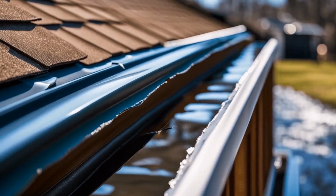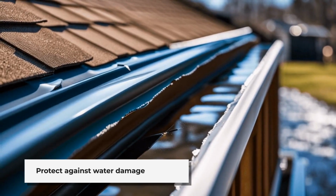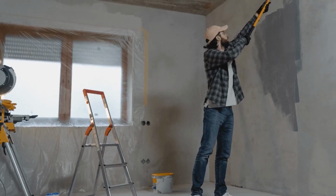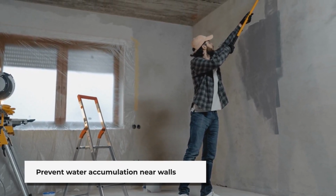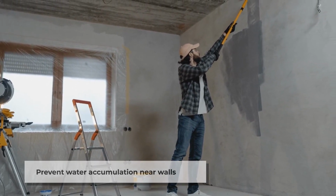Pay attention to all suspected cases. All water is the enemy. Add wider gutters, and if you can, use the vinyl, more expensive kind that snaps together. Take the downspouts and run them away from the wall, away from the house. This can make the difference from that water puddling up against the outside wall and possibly finding another way in.